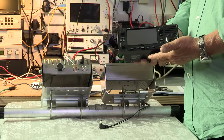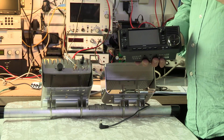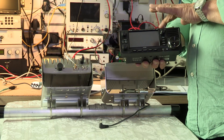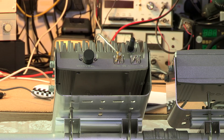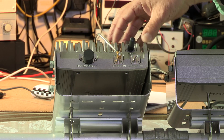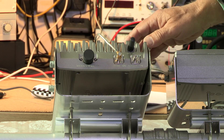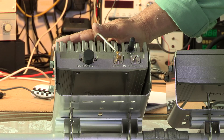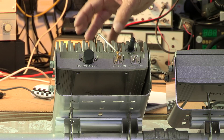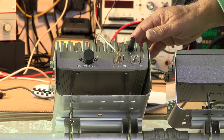To look at, you'd think it was maybe an IC-705 — it looks very like it. But all that wizardry doesn't all happen in the one control head, because it's all about loss between antenna and your RF units when you're in the microwave bands. ICOM's solution is to give you a control head which connects via a CAT cable to the RF unit, which has all the receive and transmit capability, and you mount this close to your antennas.